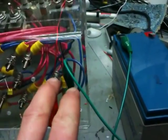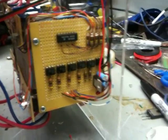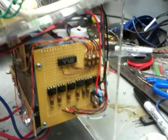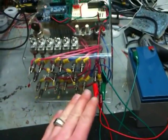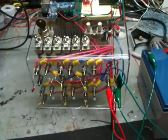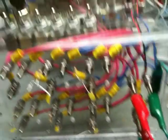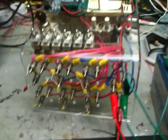You've got to give this thing 12 volts because on the isolator board there's a 5-volt regulator. You can probably put up to about 20-some volts into that, so you could use 24 volts as well. On the output side you can hook up anywhere from 0 to 75 volts for the MOSFET I'm using, and you can carry quite a few amps. I probably don't even have heavy enough gauge wire in this system to handle the amps allowed for each MOSFET.